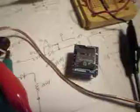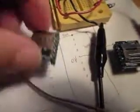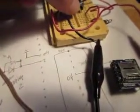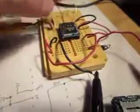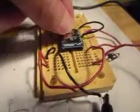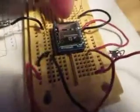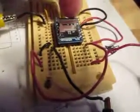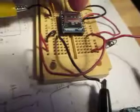So now this one is a working one. I'm going to see if I can go ahead and plug it in here by one hand here. I'm not sure I can do it. Okay, plug that in like that. Of course I have it, I guess that's in there correctly. I hope it's not backwards. It's not. You have the little cutout right here. This is a little U-shaped cutout that indicates pin 1 through 16.